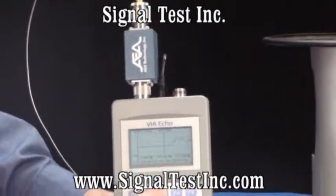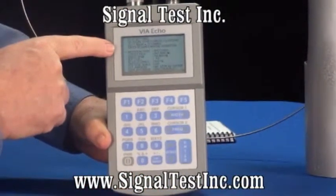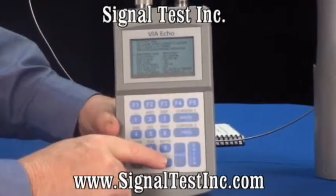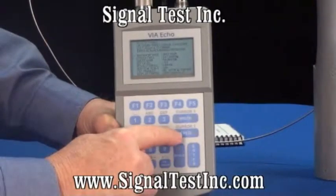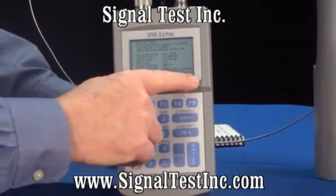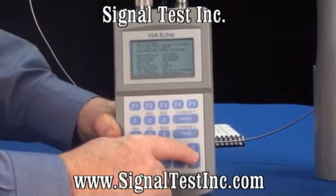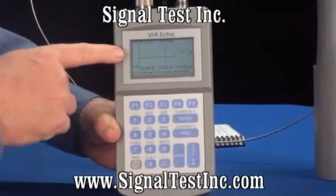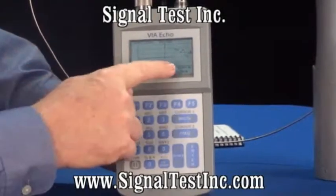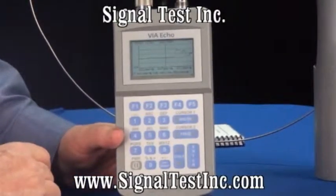I've set up the unit again using the F3 key. Going into instrument mode, I've set it for spectrum analyzer, and I've set up the same frequency and bandwidth as the VIA mode for 847 megahertz with a 30 megahertz bandwidth. Also down at the bottom, I've set for preamplifier in, and that sets the range for the increased sensitivity. Press enter, and we'll see a trace on screen from the spectrum analyzer showing that there is activity this antenna is detecting in the 850 megahertz and up range.